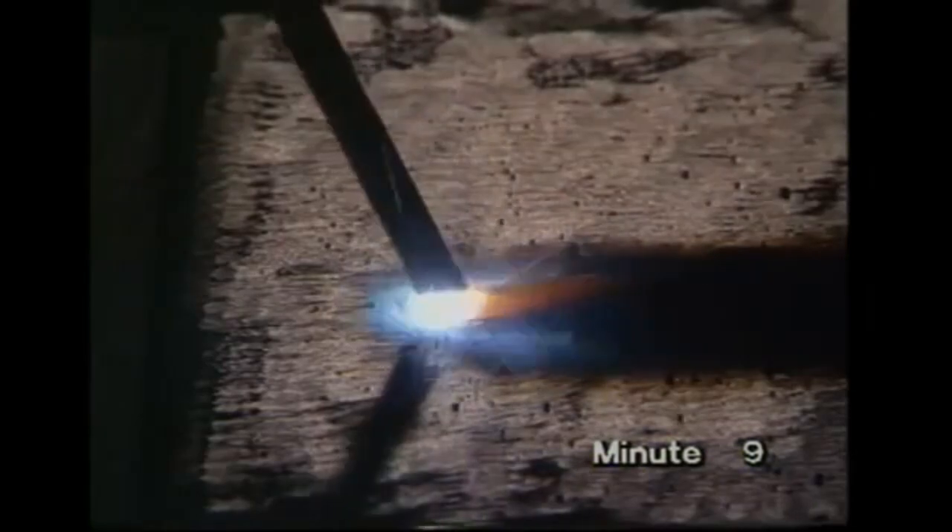This is what you should see from your position. To stop, backtrack over the end of the weld bead, then pull the electrode away sharply to break the arc. Exaggerated here.